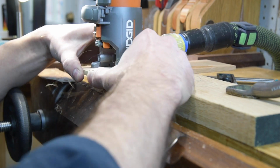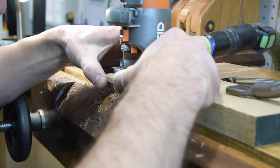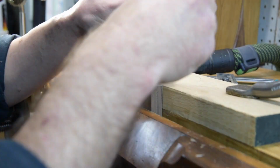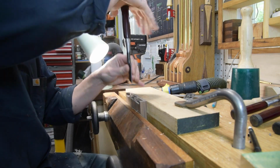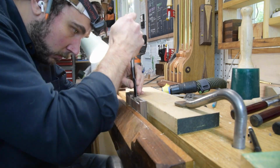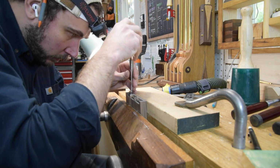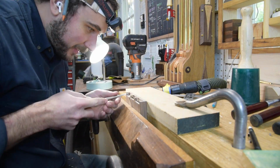And these are the drawer fronts. They got dovetailed first, and then those tapered dados next to allow for the slats coming down the front. So move a lot of the waste out with just a cordless Ridgid router. That thing is awesome. And then take in that last little bit in the corners, removing the waste by hand. Layout super important. Moxon vise is very handy for this.